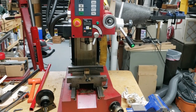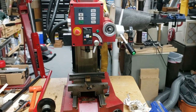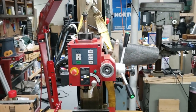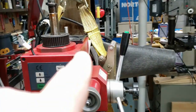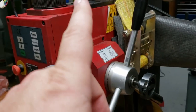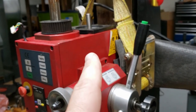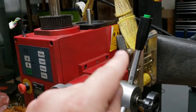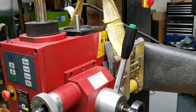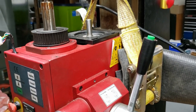It's maybe 18 to 20 millimeters too long. I need to check the cabling because on the BLDC the cables come down, whereas on the servo motor drawing they go in a different direction. Depending on which way that points, we'll know whether this thing drops in or not — I'll find out in a couple of days when it arrives.